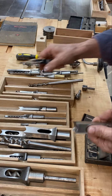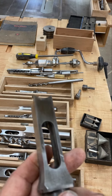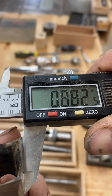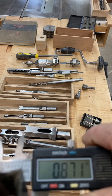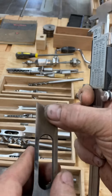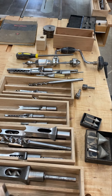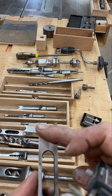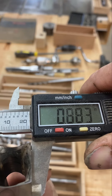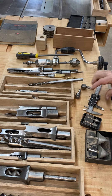The last bit of knowledge you should know is about polishing the outsides. You don't polish too much and you want to polish the whole thing. The reason is these are not parallel — the very nose measures 882, but further down it's only 871. If it wasn't that way, when you plunge these you wouldn't be able to get them out — it's like a nail. So when polishing the outside for sharpness, make sure you don't narrow or roll off the front. Don't just polish the noses like you're taught to do with regular chisels; you want to maintain that taper. That's all I know about hollow chisels — hope that helps.